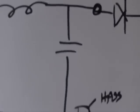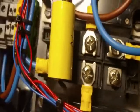And the next phase then that we said was we have our inductor. In this case, that's this big guy here. It's got 2 coils on it and a ferrite core because it's a high frequency circuit. It operates at 32 kilohertz, so it needs a ferrite core so that we don't get eddy currents and all kinds of heating and problems. So we come out of our inductor, we go into a small capacitor, which is this guy here. This is an MKP capacitor, which is just there to smooth out any very big pulses, that sort of thing.